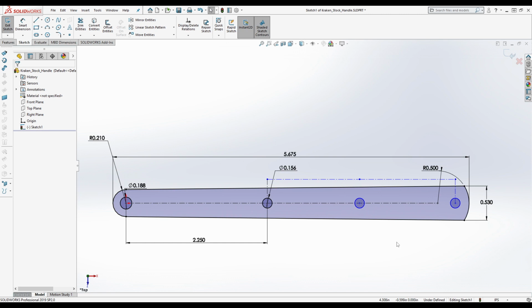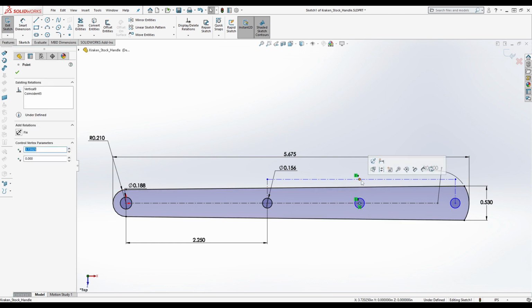And to be honest with you, I don't know that I want to push the pin out. Why? Because it's aluminum. I see. And why? Might damage the supporting material? No, aluminum is not particularly abrasion resistant. And so if you're pushing a steel pin out of it, when you put it back in again, it's going to be looser, right? Do you see what I'm saying? Okay. And so I feel like it's one of those things. There is no way around that. If you screw it up, your best bet is buying a slightly larger pin and then pressing it in. But if you were stuck using the same pins, the handle is now scrap, and thus the knife is scrap, right? So that's why.